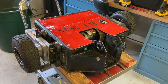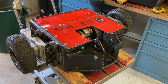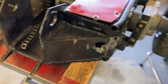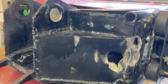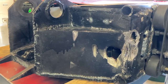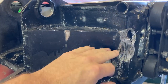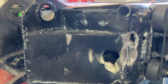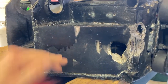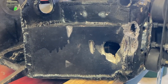Here's poor StinkEye after the RoboGames event. Right now I have the weapon taken out, but the rest of it is pretty much how it came home. This little love mark right here was from Magnitude — this is a 3/16ths AR plate that got bent in, a big hole taken out of it, so that's actually a pretty good hit. In fact, this hit bent up the entire front of the robot, so that was a pretty solid clobber.